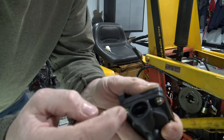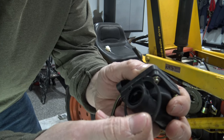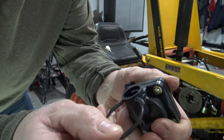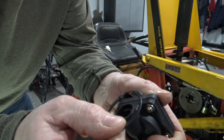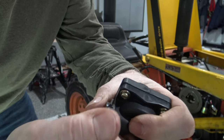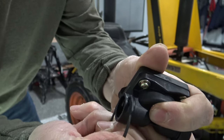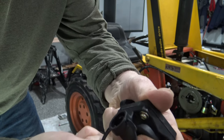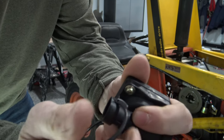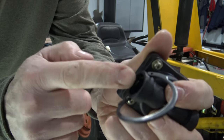The first tip is how to get this snap ring on — you don't need snap ring pliers. Bring the snap ring over like this and then pull up. Don't try to start at the top and push down. It's much easier to bring it over and pull up one side, then pull up the other side. Just like that — now you have the snap ring pushing in the retainer and you can insert your fitting.